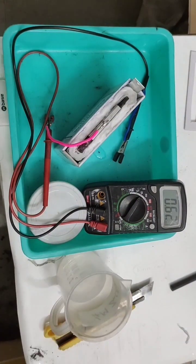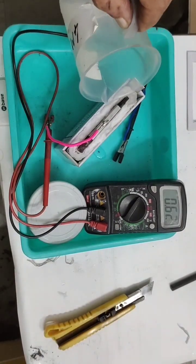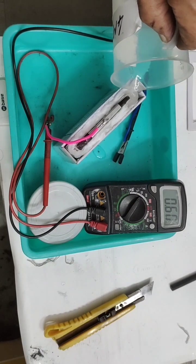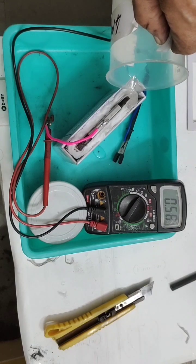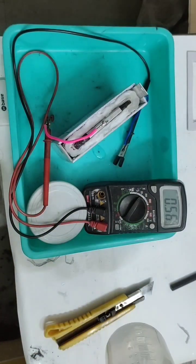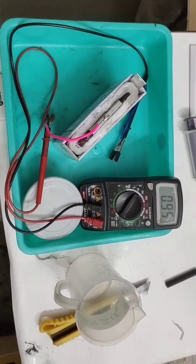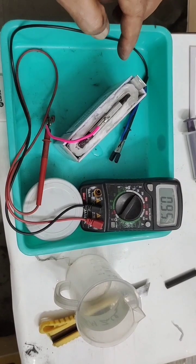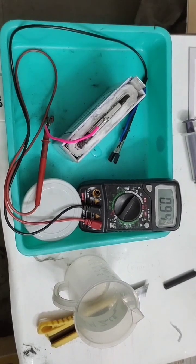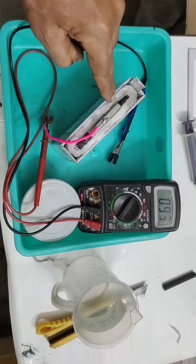It is slowly gaining voltage. It will actually need around 75 ml, but I only prepared 50 ml, so we will see. The voltage is slowly getting increased. It requires more electrolyte, so I have to prepare more and inject it into the container. At present it is 0.95 V — I have to fill up and wet all the pad with the electrolyte.